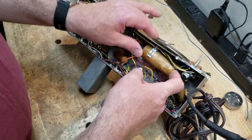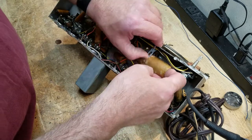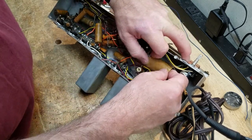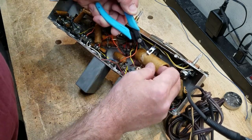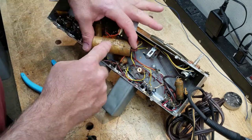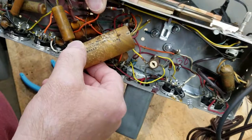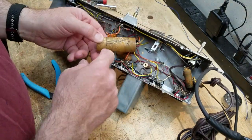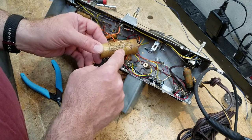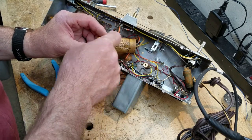The first thing I want to do is replace this electrolytic capacitor. These kind that are clipped like this usually just slip right out. You have to be careful with what's around it — I'm going to have to watch this little coil. There we go. Wow, look at how that thing is deformed — isn't that interesting? I got a feeling that's been like that since it was new. Whether or not this is an original capacitor for this radio, it's hard to tell, but that can't be right. That has to have affected the performance of this thing.